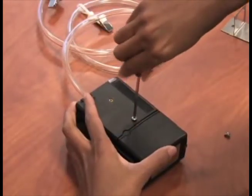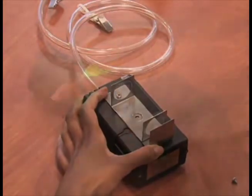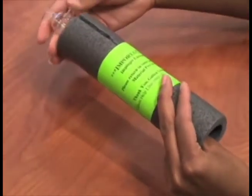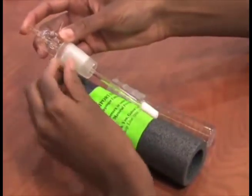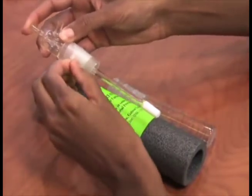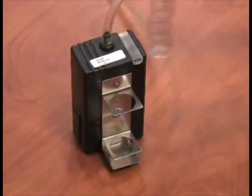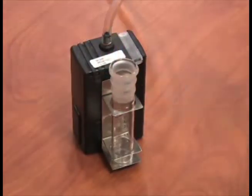Remove the two screws on the front of the pump and reinstall with the impinger holder in line. Remove the impinger from the foam packing material and save the material for return shipment. Separate the impinger and remove the paraffin wax from the top portion that prevents the impinger from fusing together. Insert the bottom portion of the impinger into the impinger holder with the units of measure visible.